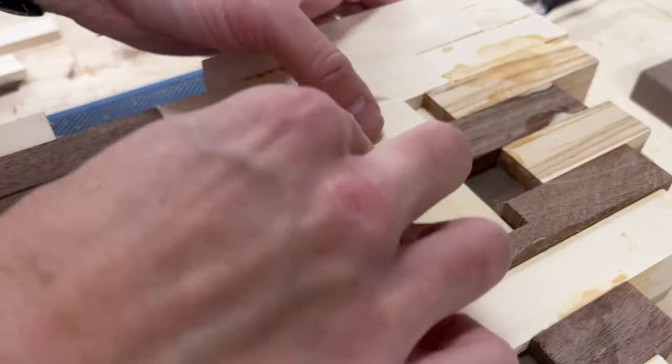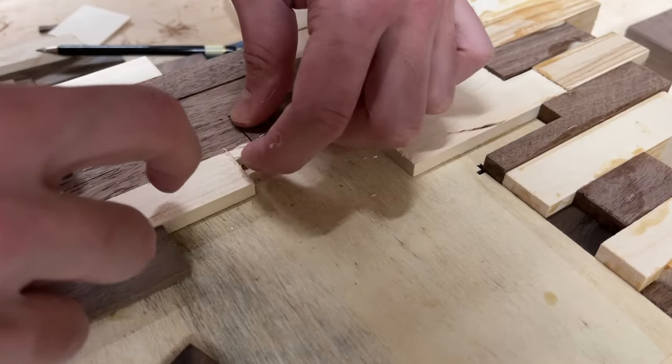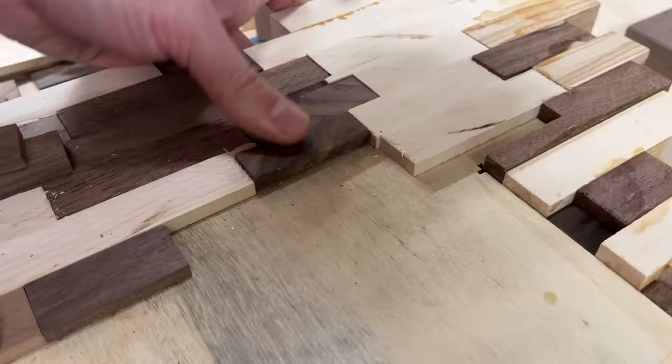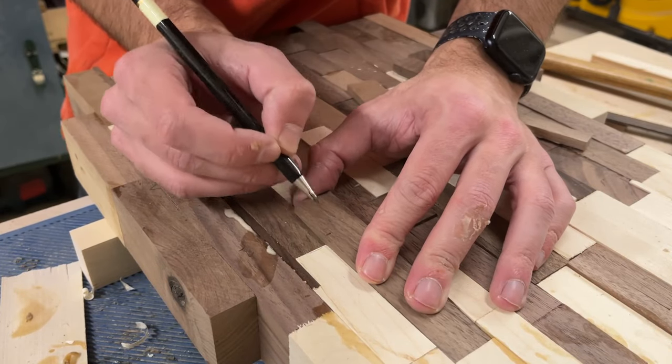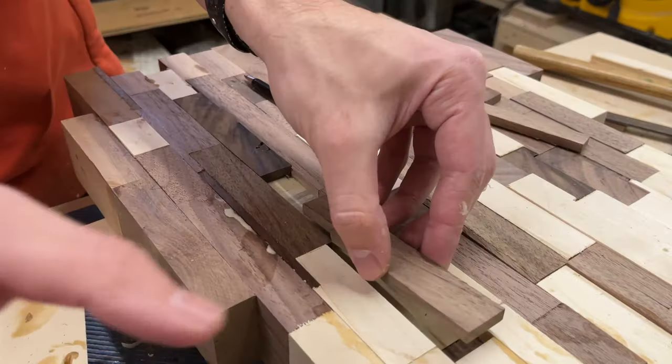However, I had a gap that was too big for this method. With large gaps, you need a lot of glue to close the gap. This results in the glue releasing too much water, sinking and not closing the gap properly. In addition, glue is not as strong as epoxy.